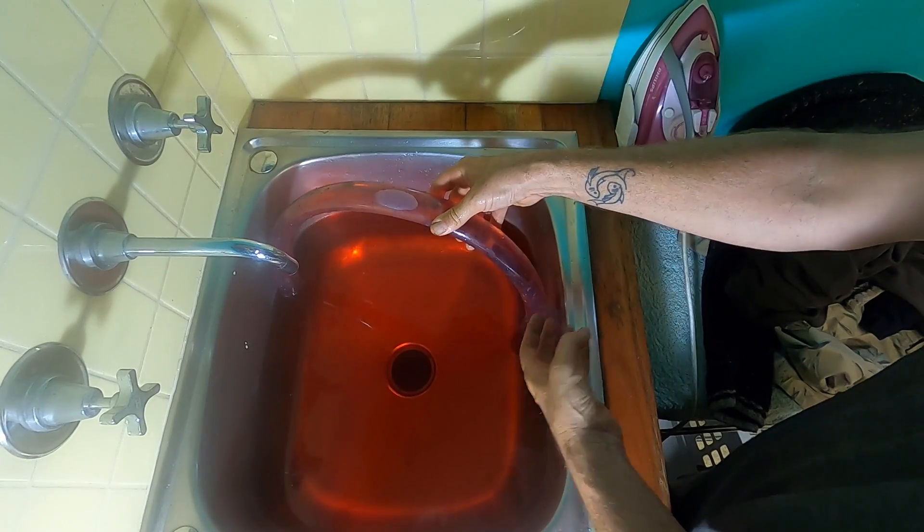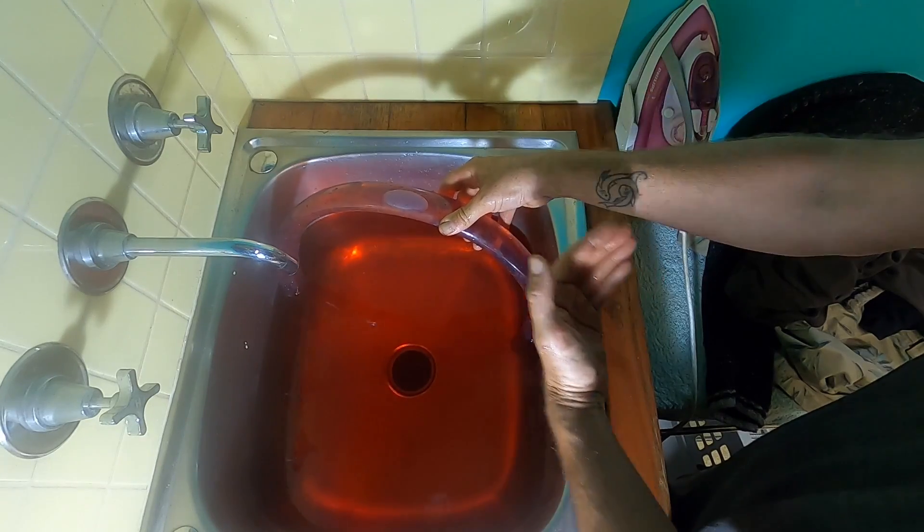There's no way for air to get back into the system unless there's a physical leak at one of the hose clamps or something like that. One of the disadvantages to having both the inlet and the outlet below the water line is that you've got an extra skin fitting — an extra opening in the hull below the water line — and that doubles the chance of something going wrong. You mitigate that by having high-quality skin fittings, servicing them regularly, having your bilge pumps, having your bilge alarms, all that kind of stuff. But it does increase that risk slightly.